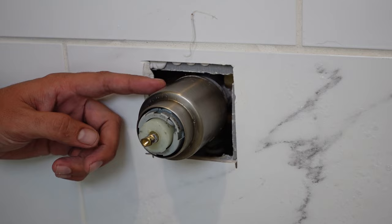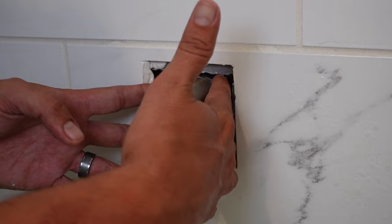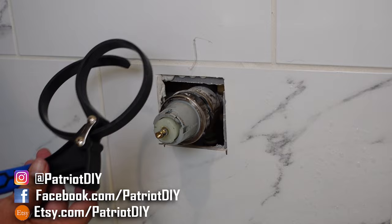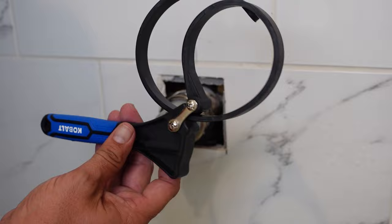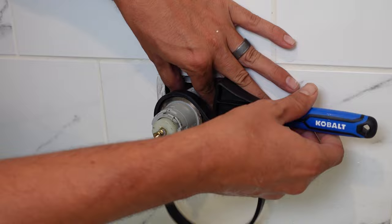Next, we have this decorative metal collar that we want to take off. Now, we don't want to put too much stress on any of these pipes and stuff back here, so anything we do we're going to want to be very gentle about. So I'm going to get in here behind it and just very gently start to pull that off. Next, we have this other threaded metal collar here, and the best way to get that off is going to be with a rubber strap wrench. If you don't have one of these, I will link to it in the description below. So we're just going to wrap our strap wrench around here, tighten it down, and then as gently as possible without putting too much stress on the valve behind it, we're just going to rotate — and that broke it loose. Now I can take it off by hand.